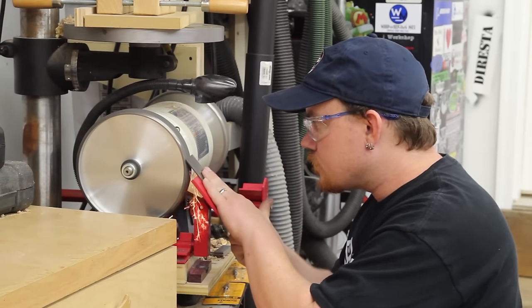I'm not going to go into a full-blown demonstration on how to sharpen an edge because there are so many different techniques and videos out there. But I will say I am using Paul Sellers' recommended diamond plates and I'm using Rob Cosman's method for sharpening. Once the front edge is just absolutely razor sharp, you should be able to feel a burr on the backside. You can remove this burr and sometimes it comes off in a nice long piece — a full length burr that was on the entire backside of the cutting edge. This tells me after it's removed that this is razor sharp and ready to go.